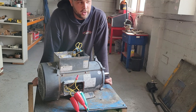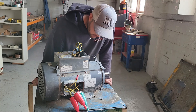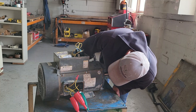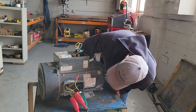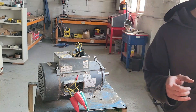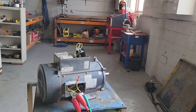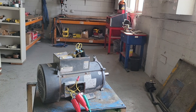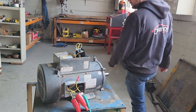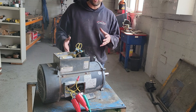I've got it on a better breaker now — this one's rated at 40 amps. A motor of this size is typically rated at 30 amps, so we're covered. Here we go. Did you see that hop? There's way more energy in there.